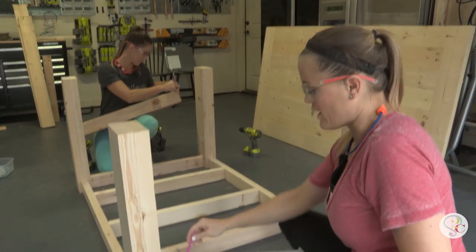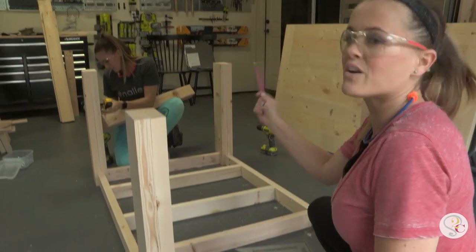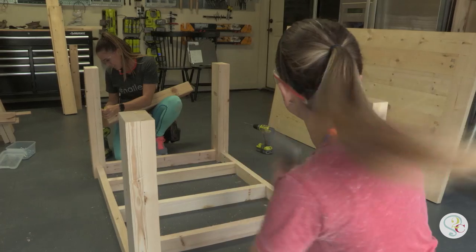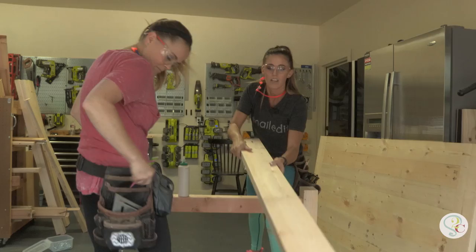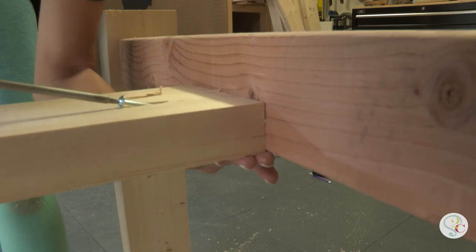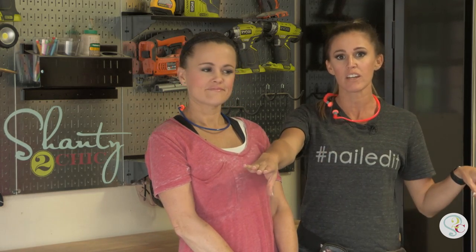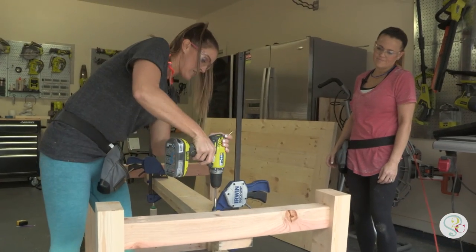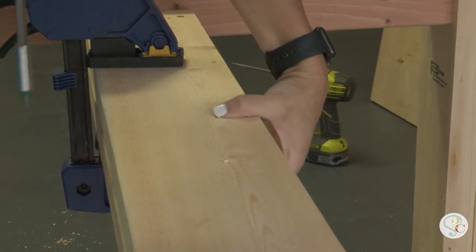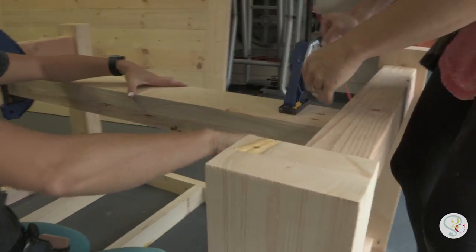So right here we have our aprons, our supports, and now we're about to add runners — a little vocab lesson for you! We've got the frame done and we're going to put runners that stretch between both legs. The first one is the short runner, attached with 2½-inch pocket screws, flush with the top of the leg runners. Then follow up with the longer runner — clamp it in place and attach it with five screws. It ends up looking like a big chunky runner going through the middle of the table, giving the look that this board is cutting into the leg runners.